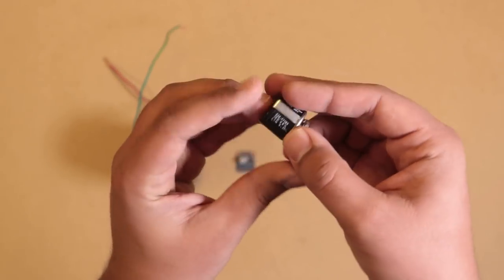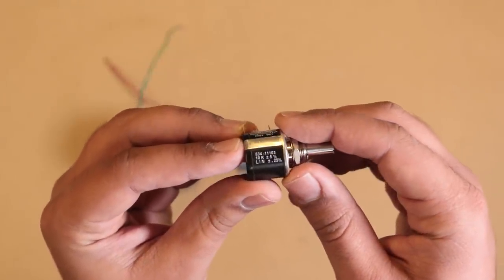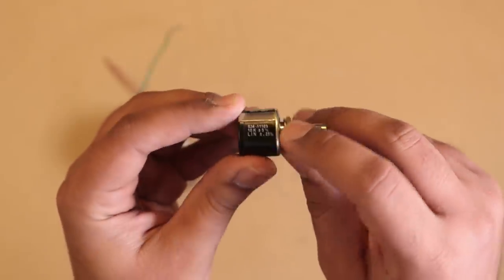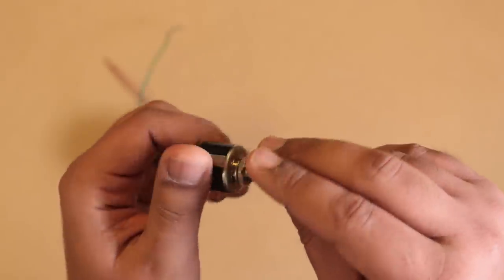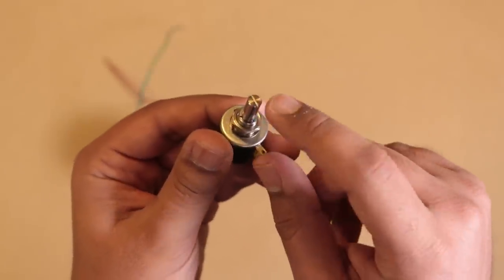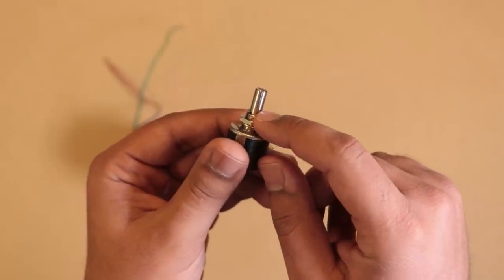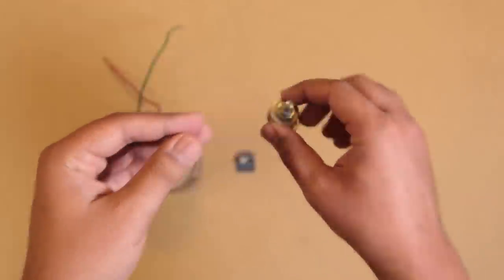This happens to be a 10K potentiometer, and it's a 5% precision, which is good enough, and plus or minus 0.25% linearity, which is pretty good. And it's got a nice quarter inch or 6.35 millimeter diameter shaft, which is nice and easy to couple to.